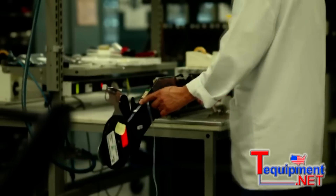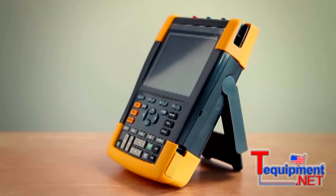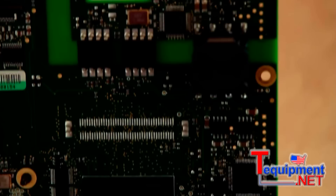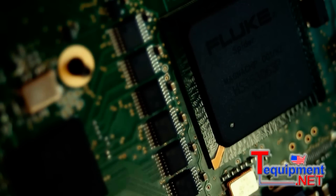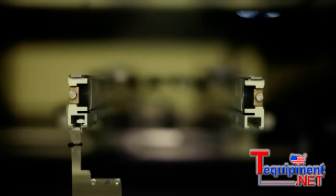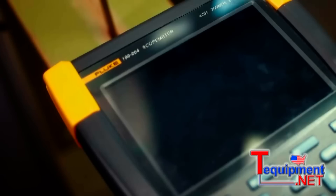The main thing that sets it apart is the low power, which makes it suited for handheld products, but also the compactness. What we do is integrate half an oscilloscope on a single chip. We wanted to get rid of all these parallel chips, so we made a single chip acquisition system with four input sections. We made them in a way that you can combine those channels to achieve one channel at very high speed — giving you maximum low power, maximum compactness, and maximum ruggedness.